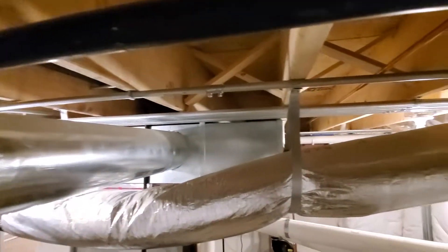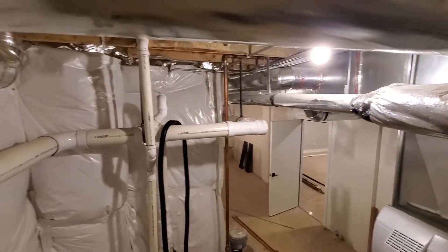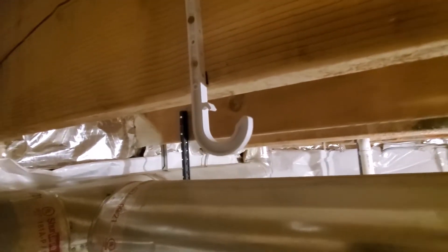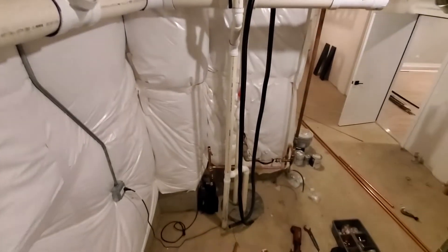What I was doing here is measuring off that duct because it's pretty straight all the way across, so I was able to get a measurement to give me where I need to put my hooks. For how low, I just measure off the bottom hole — I use the holes on these fittings if I can — to give me an idea so I can line those up and put my pipe across to get my run there.